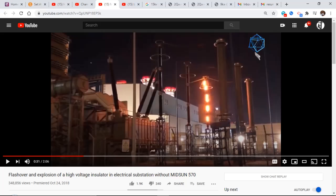Another thing, and I don't know the location of this, when we had power lines up and down the boulevard of Myrtle Beach, Garden City, and North Myrtle Beach, this was a common occurrence, and we were starting to get pole fires from it. Now, why do I say proximity to the beach? Salt. Salt spray, gentlemen, salt spray. So the salt crystallizes on these insulators and then makes it very conductive up and down the insulator, right? So you've got to have some type of contamination, and that kind of contamination is happening right there. And usually it is tied with moisture.